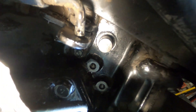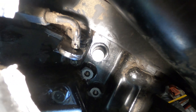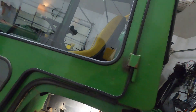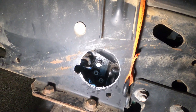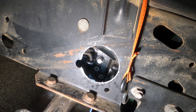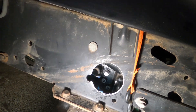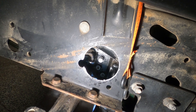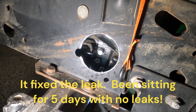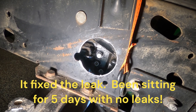And now I have access. If this ever comes apart or leaks again, it's going to be much, much easier than trying to tear down this entire machine. Because the other alternative is taking the cab off, taking the fenders off, taking a lot of this body off so you can lift it up and access this. By cutting a hole you get the access, and quite frankly, I really don't think I'm going to have a whole lot of issue with weakening the frame — this frame is pretty strong. So I'm going to get it cleaned up, get the oil back in the machine, run it for a little bit, and hopefully it fixes the leak.